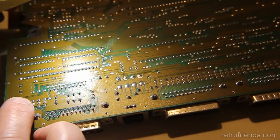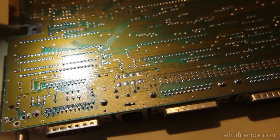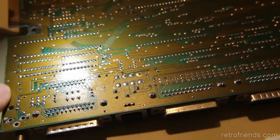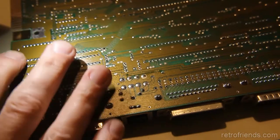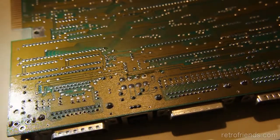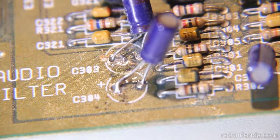Yeah. I'm just going to check the polarity of the caps, which is pretty easy. You don't need a schematic for that because it's quite obvious where the ground is. And usually the caps have one end that's going to ground, the normal ground plane on the board. So I'm going to just check that out first. Yeah, most of the capacitors look okay,